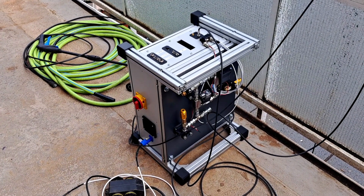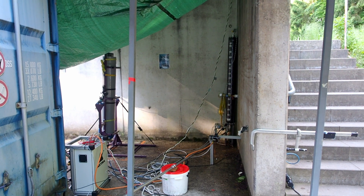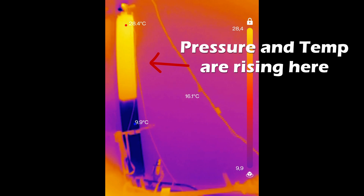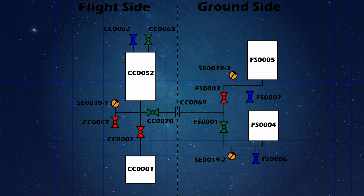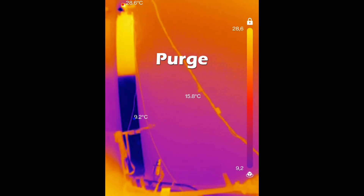There are also two other valves on the tank to think about. The first is the purge valve at the top of the tank. This is important for the nitrous oxide filling process because as you fill liquid nitrous oxide into the flight tank, some of it will gasify and start getting compressed, causing you to reach an equilibrium quickly — usually before you reach the desired fill level. By opening the purge valve, you let out gas, reducing pressure in the flight tank, which creates a pressure difference again allowing the bottle to push more liquid nitrous oxide in. This valve isn't strictly necessary but definitely provides a quality-of-life improvement.